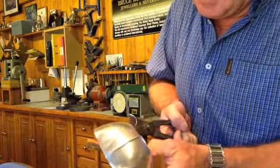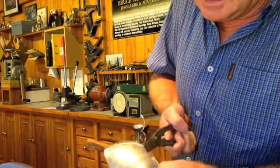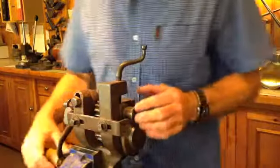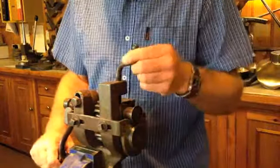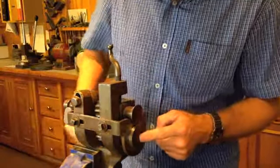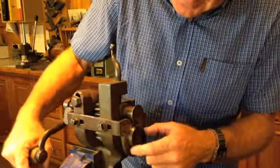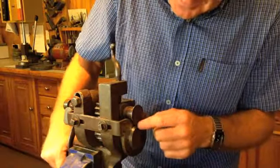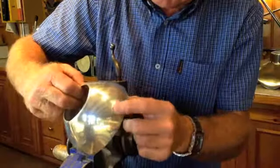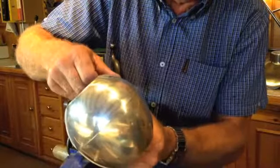So just cut that off with a little pair of bent snips like this. As we come around, again it's just all done by eye. This tool here is a Jenny — a very old tool. It's got two wheels and as you turn the handle around you can put a piece of metal, in this case the silver, into the wheels here. And you can throw out the edge so that on the top section here I'll throw it out, then pull it back in on itself, and then I'll get a perfect fit of the two sections.